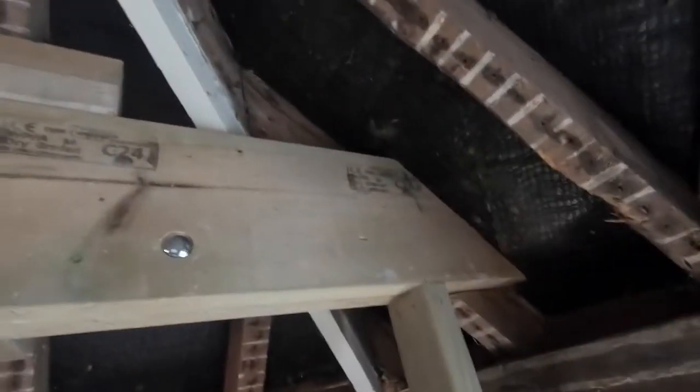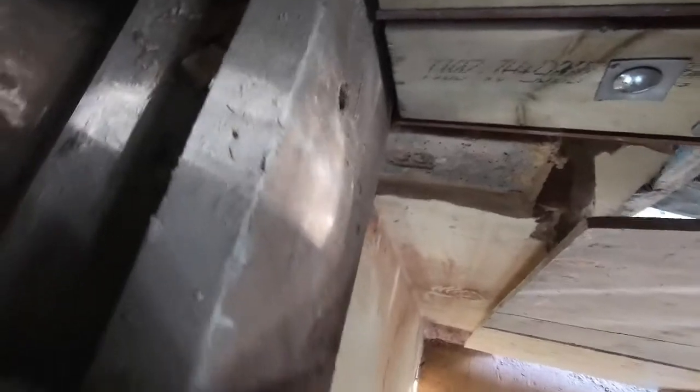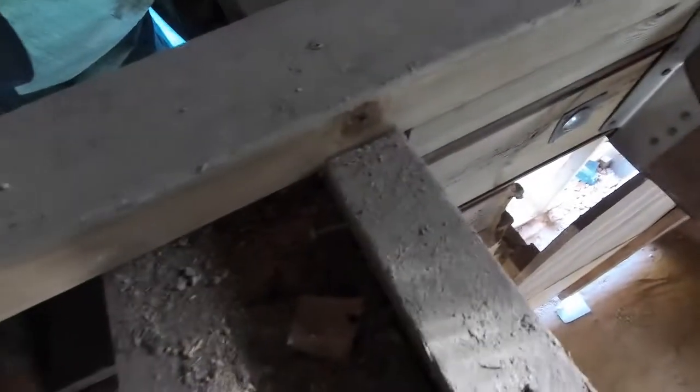Then that's that part. Now, how it ties in, you asked about, ooh, just lost my nail. Okay, how it ties in on the brick pier. So you've got that steel coming in, that they're both not tied in together, that steel coming across. You see that it's sitting on that padstone, but effectively they're not tied together at all, it's just resting. See there? So if we need to tie that in somehow, you have to advise us on that.